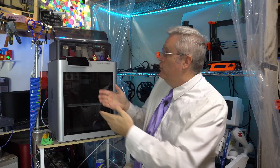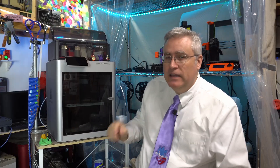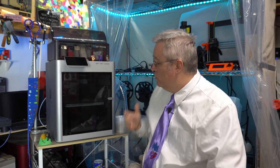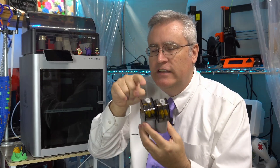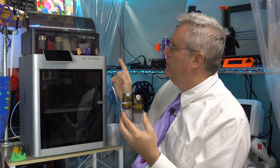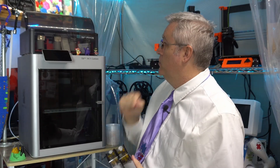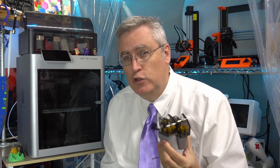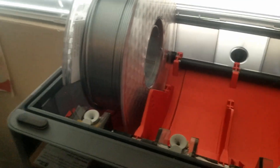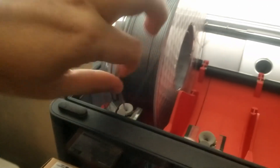Now, under Bambu's direction, I took apart my AMS, cleaned up the second stage feeder, and tried again — that didn't fix it. They said it might be the first stage feeder, those little blocks in the front of the AMS that pull the filament in to begin with. So I purchased two new first stage feeders. I noticed these were a little bit different from the ones in my AMS — mostly aesthetic, these ones have yellow gears, the old ones have white gears. I didn't think it was going to be a big deal. So I pulled out the first and fourth stage feeders and replaced them with the new ones. But something weird started to happen: every time I tried loading filament into these feeders, it would push it out — run it the other direction instead of pulling it in.